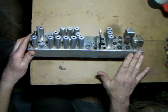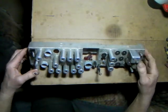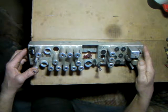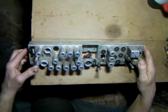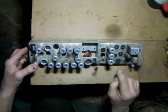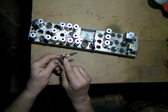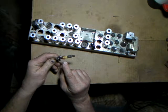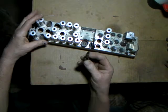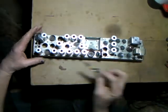This is the receiver section from an old Motorola FM business band radio - I believe it's called the T Power, a late 1950s vintage. It had all the right tubes: a 6CB6 and 6BJ6. It has coils and coil forms that will be valuable when you want to wind your antenna and mixer coils for your shortwave receiver. Each one of those little cans had one of these little coils inside, so you'll get a lot of that kind of parts.